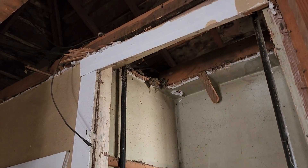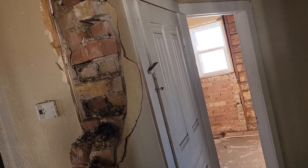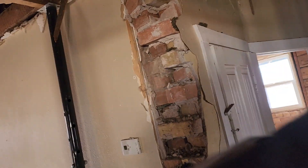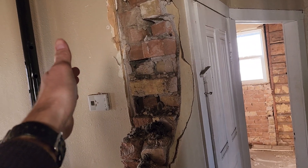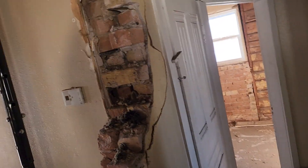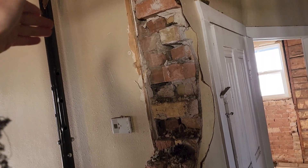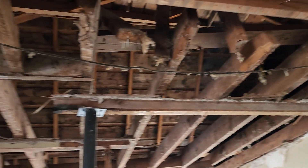This wall door right here goes to the basement and the furnished room. I'd have to tear this all down and build a new wall here to support the trusses going east and west. There is a closet in this bedroom over here — I'll be able to tear this down because that closet will be able to take the weight and support of those trusses while I tear this down to rebuild it. Can't wait till all this old stuff is gone and out of here.